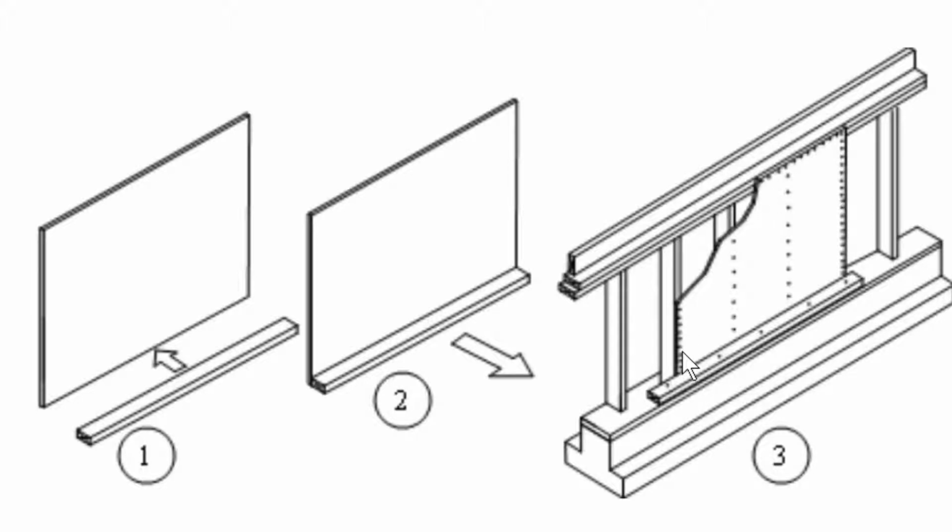along here. And this is actually one of the ones that's on the most preferred list. We actually had these evaluated by a very high-powered engineer who did research on these things. And he said this is also a very good one because it also mimics the tested systems, which had 2x4s on the top, on the sides, and on the bottom. So it's just another way of doing a very good connection to the mudsill.